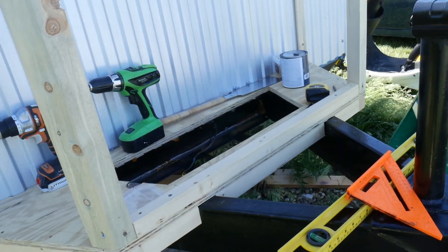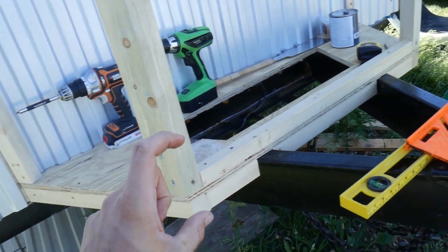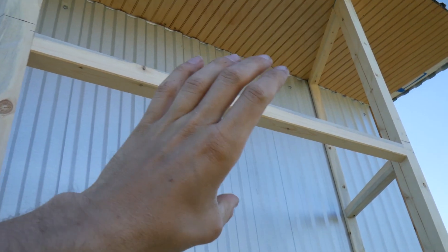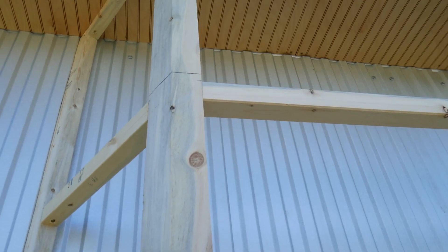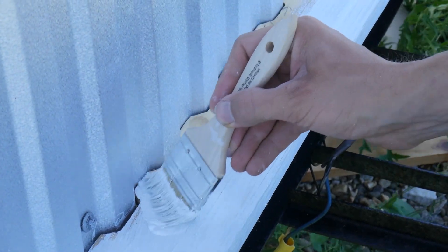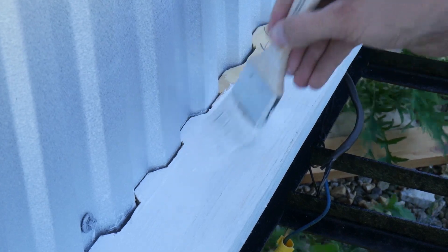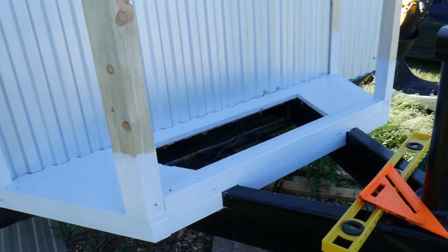My next step is to give this section more water resistance — I'm going to paint at least up to a foot with some exterior white paint, and maybe all of the beams if I get overzealous. Also worth noting: this is going to be my second shelf for the mini split. These beams are not only for more attachment points for the sheathing, they're also going to support some OSB. I'll just notch out these beams and put some supports up against the wall to hold it up because it's pretty heavy. Since this is the inside of the box I'm not even worried about taping it.